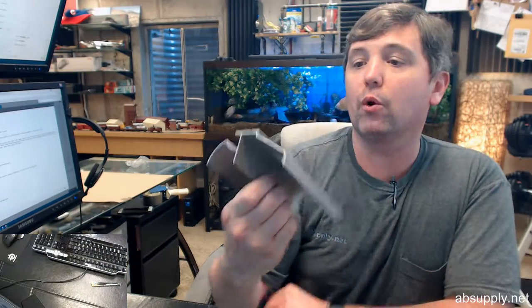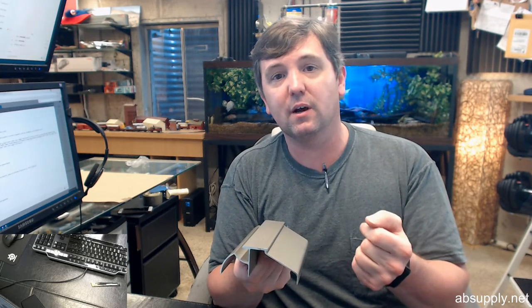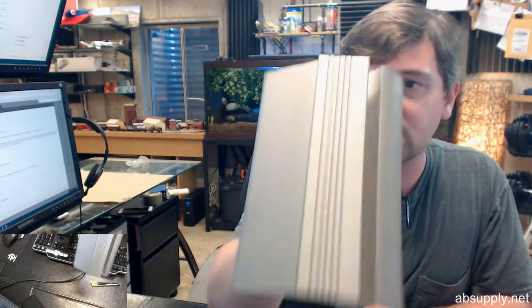There's really nothing to be worried about in the sense of it not matching another piece of weather stripping, in the sense that it won't be completely identically adjacent to a piece of perimeter gasketing, nor is it an adjustable oak or adjustable aluminum top satin nickel threshold where you're going to add an extension. Sometimes those two pieces have not been exactly the same satin nickel, but this is an exceptional finish, in my opinion. It's complementary, it's not exact. Anodizing is not plating something on solid brass like satin nickel actually is.